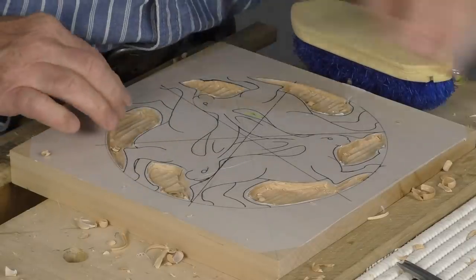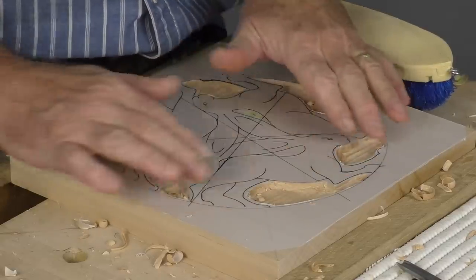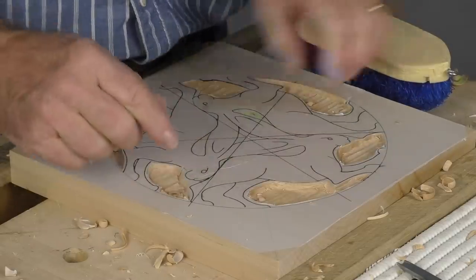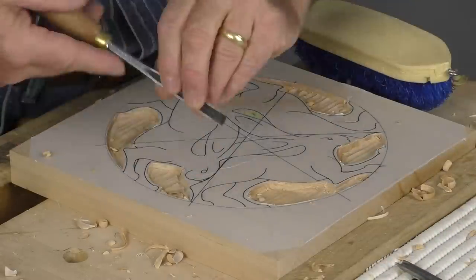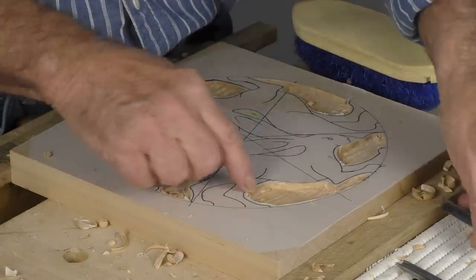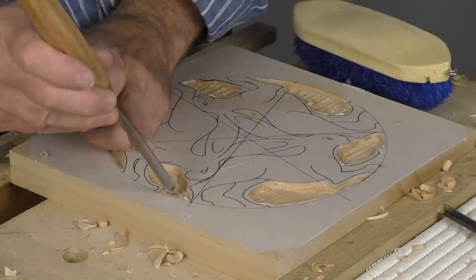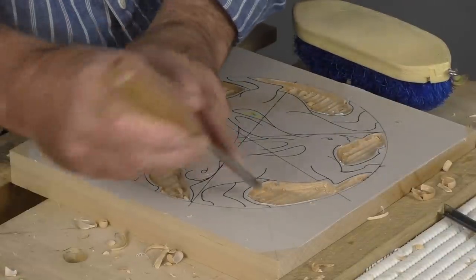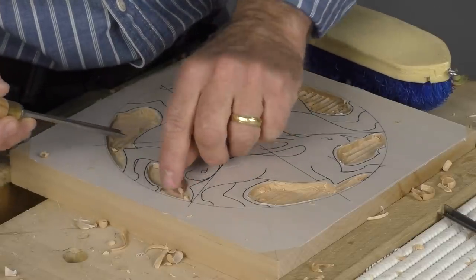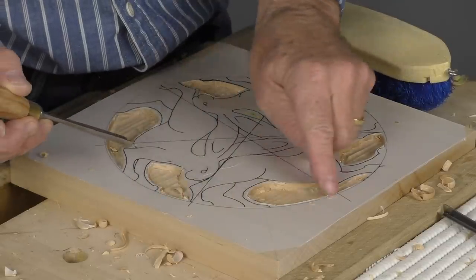I've been around the bigger areas getting them to the depth, and I can sort of see the background underneath, which is great. One of the things about lining in like this is that it protects the edges. Now these are going to be rounded over — the legs — so I'm not too worried about those, but when you come in across the grain you're likely to bruise the edge of this wood. That's why that extra bit we've left is very useful, because we want a nice tight line as we go around.